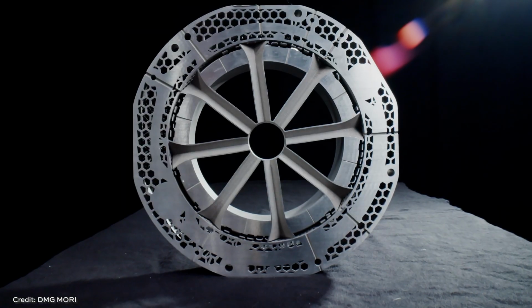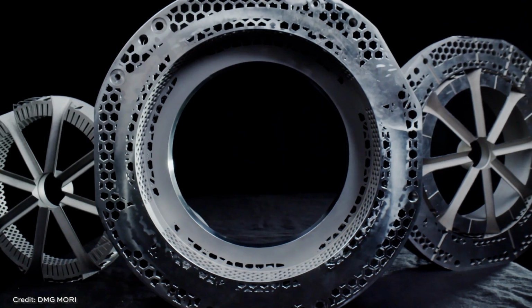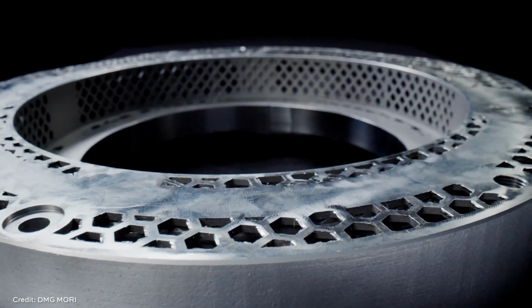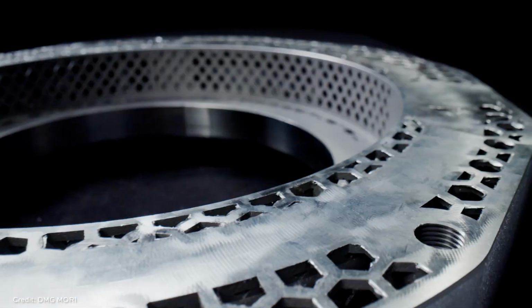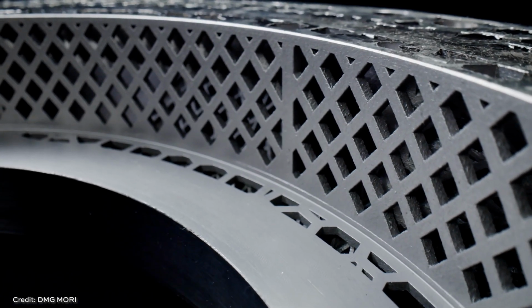After it gets vacuumed, it goes through heat treat, it goes through finish machining, and you end up with this final part. This component is lightweighted. It weighs about 8 kilograms versus the more than 15 kilograms that the original did. It's more reliable, it has fewer sealing points, and this is just a great illustration of additive manufacturing helping subtractive manufacturing.